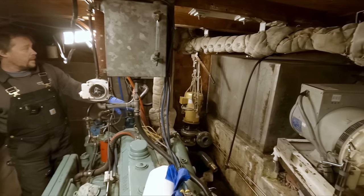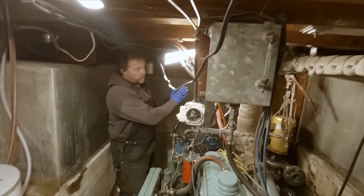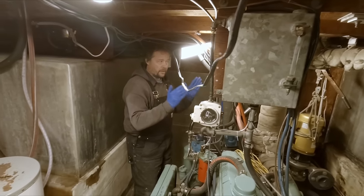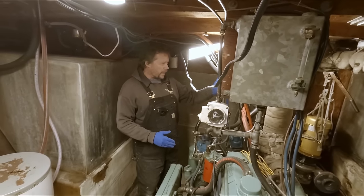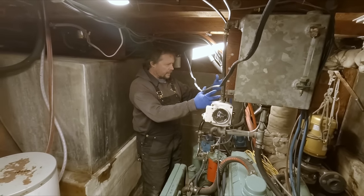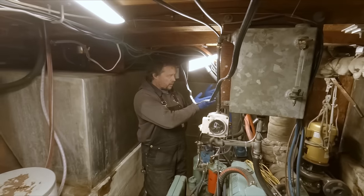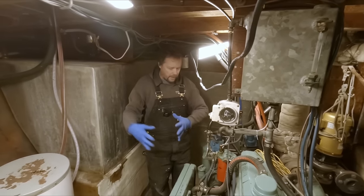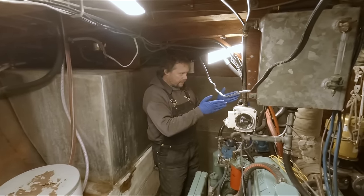And so by cutting this tank and converting a portion of it into a hydraulic tank and the rest into a fuel tank, we still have that room to break it apart. And that should give us enough wiggle room to be able to take out the small section that we convert into a hydraulic tank, get that pulled out of the way. The other piece we can push back and pull it out.